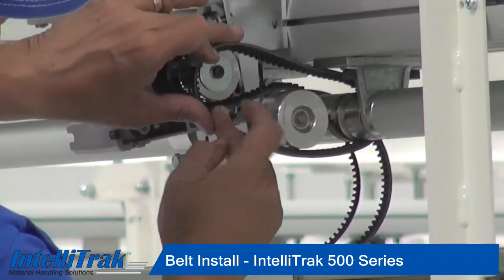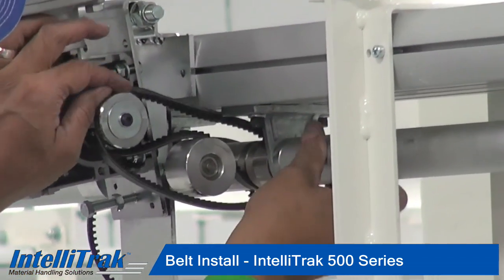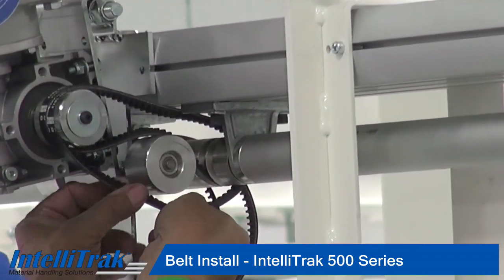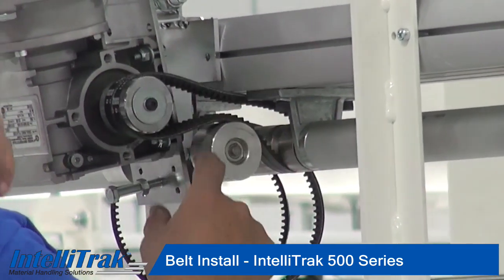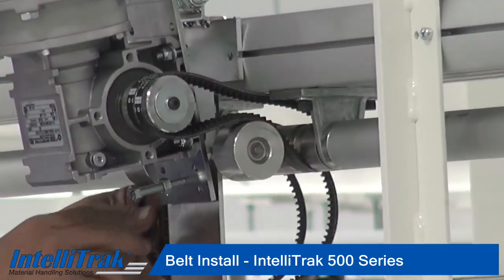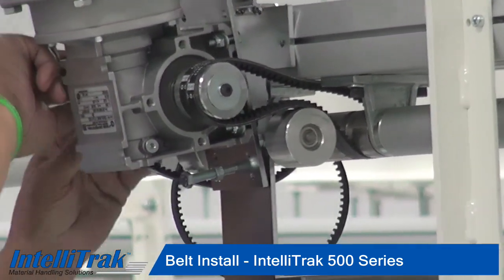And I find it's easier to twist the drive tube to get the belt to slide over the pulley. You'll do a half twist and get it over the idler. So the belts are installed on this side. And then you do the same thing on the opposite side.